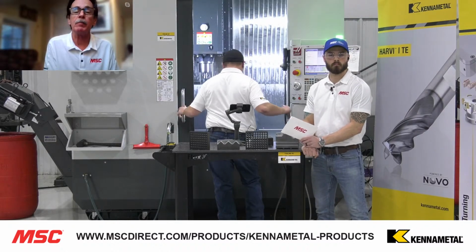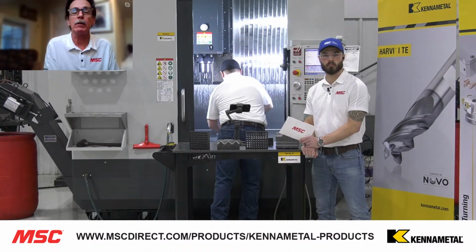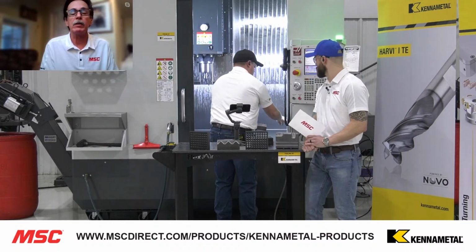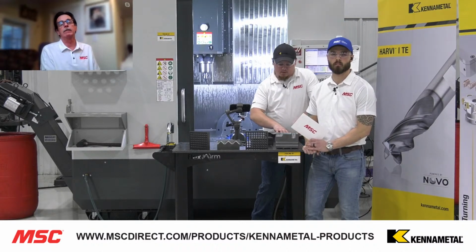you might eliminate a complete operation and a tool change by taking out a high feed mill to create that pocket, or drilling to create that entry. You can use this end mill and totally eliminate that operation. And obviously, any time you do that, you're going to open up capacity.